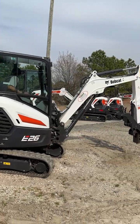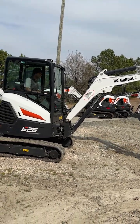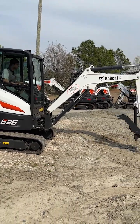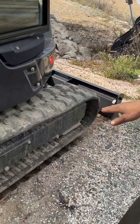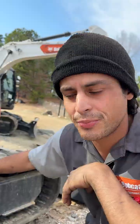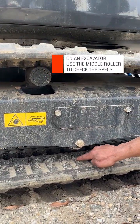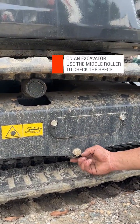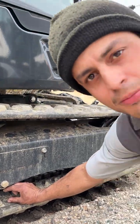I'm going to turn the whole turntable machine around and we're going to have the boom to the back. After I move the boom, you put the blade down and then the machine will lift on itself. We need half an inch of space between the bottom of the track and the edge of the roller — that would be the specs of the track.